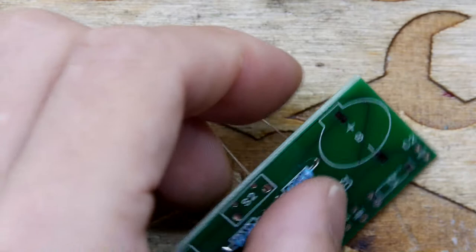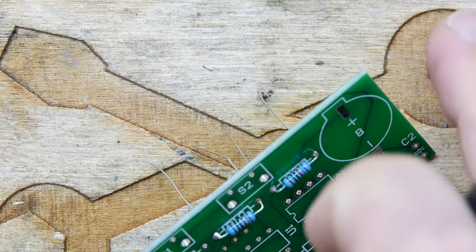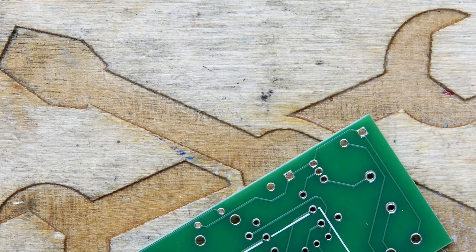You can see if I just hold the soldering iron to the pin from the top, I can actually feed it in. Through capillary action, it'll draw it through to the bottom edge, which it has done nicely there. That's why they're not falling out. Then that gives me the opportunity. Oh, what did I touch? I touched something burny with my soldering iron.